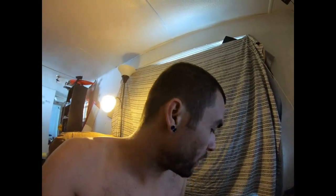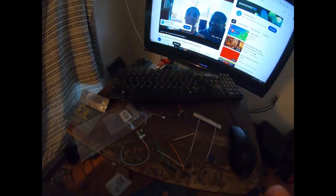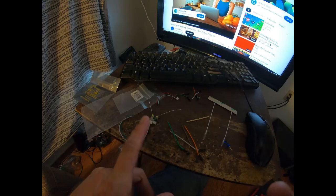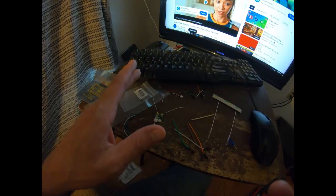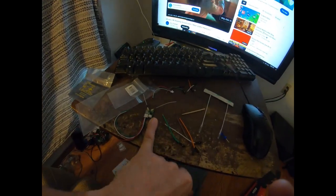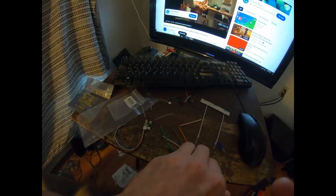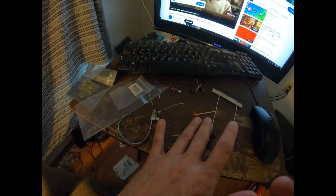Okay, so after me bitching and looking on their website, I found some stuff, and I'll clip it in there, but it is a lot easier. If you just get that in the package like how I showed it, it's confusing because you don't know what plug is what, and on their website it does break it down. This is for your battery side. I think it goes positive, negative, and in the middle it's S-bus. It's not used yet. They're going to update the firmware, and I'm pretty sure that's going to be for Spektrum and other receivers, where you can plug it into the receiver for power and then talk through S-bus for telemetry and stuff like that, and still be compliant and get GPS through your controller.